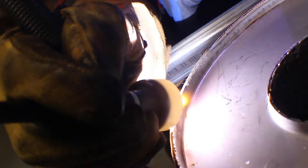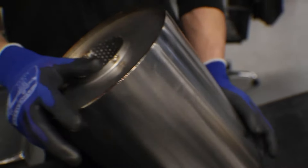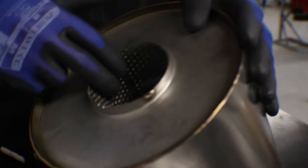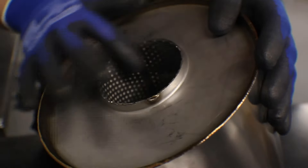After tacking the perforated tube into the baffles, wrapping the perforated tube with the acoustic fill, and assembling the silencer, it's a case of doing TIG welds on the positioner to get that nice pulsed rotary weld look — nice, consistent, reliable welds, which is obviously the most important thing. We can put loads of work into making them look pretty, but if they don't last, all that work is useless. The last step once it's welded is to stretch out the inside — swage or expand it.